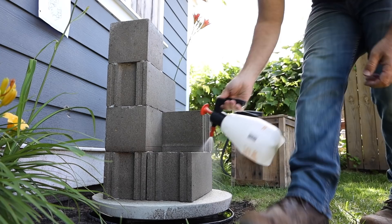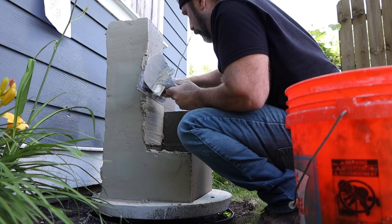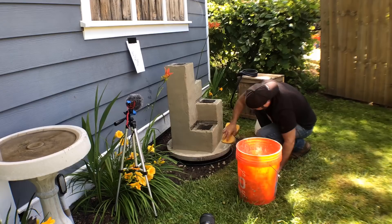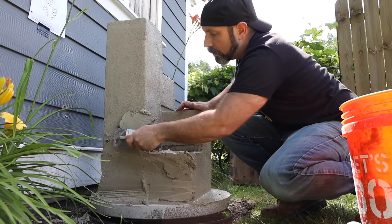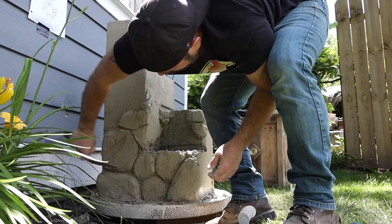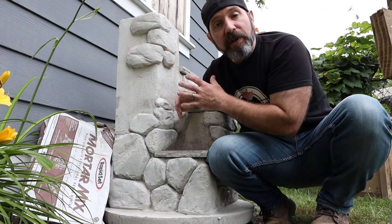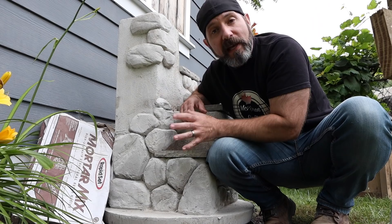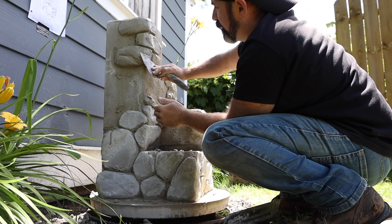Start by coating the block with a very thin quarter-inch layer of mortar mix. After everything is nice and flat, take a damp sponge and lightly rub the surface, exposing the aggregate and giving it a nice stucco texture. You could leave it just like that - it makes a statement all its own. But here on this channel we always take it one step further. Add another half-inch to three-quarter-inch layer where you're placing your rocks, take the edge of your trowel and draw where you want your rocks to be, then simply round the edges over. You can get creative with textures using the edge of your hand, a mason brush for dimples, or a damp sponge. Then take a flat trowel and hit a couple edges to make some flat spots - and that's pretty much it.